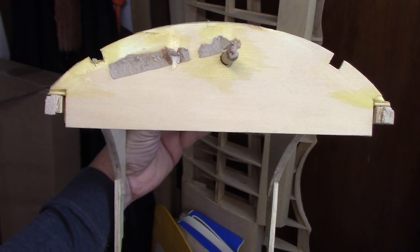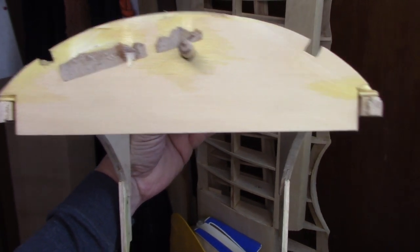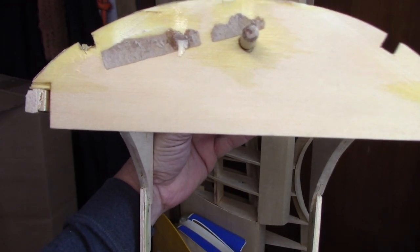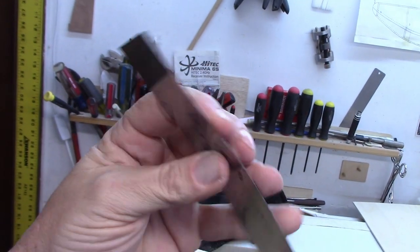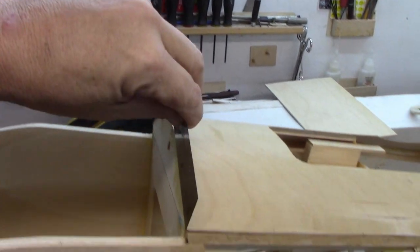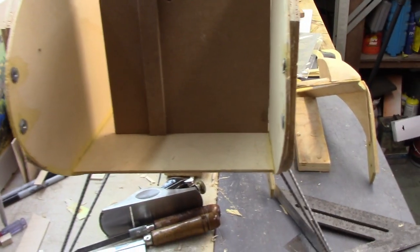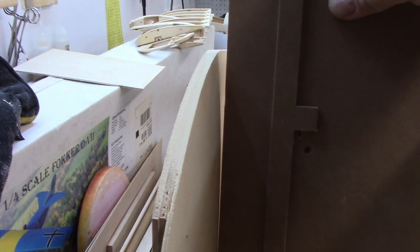For some reason he used cardboard as a spacer, and look at all the glue that wicked in around that cardboard. I had to come in with one of my little Zona saws — I took the handle off so it's just the bare blade — it's just the most flexible way to get into a cut somewhere. I went in and cut on the back side. I didn't find a square but I found something that is square. You can see how it's cupping out at the top; that's going to have to get all glued back in. You can see how much that side is tweaked out too.